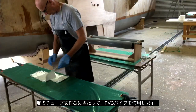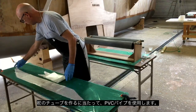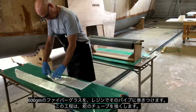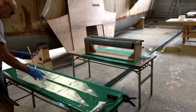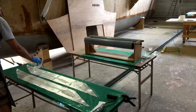To make the rudder tube, I start with a piece of PVC pipe and I wrap it with some 600g biaxial. That will give it more strength and help with adhering to the tube with the other glassing schedule that's required later on once the tube is fitted into place.